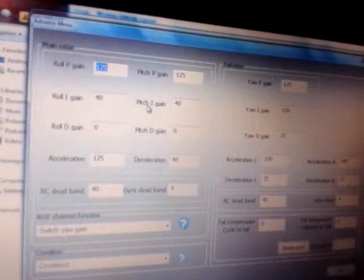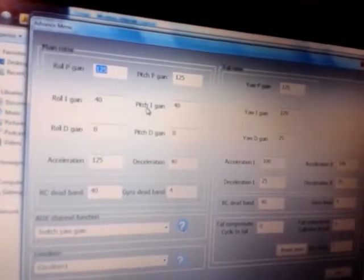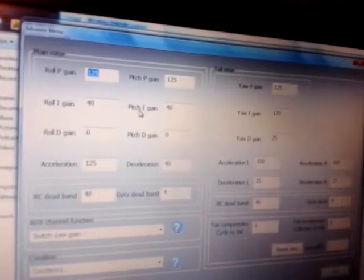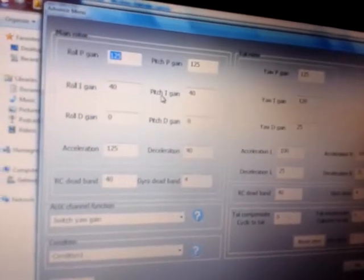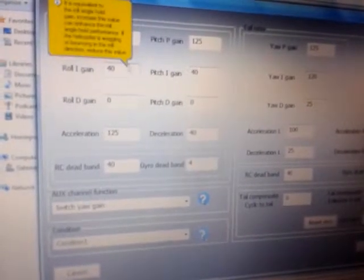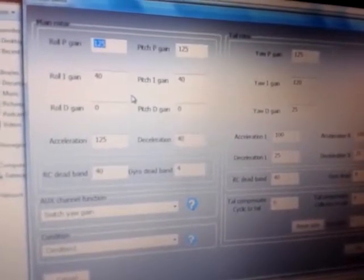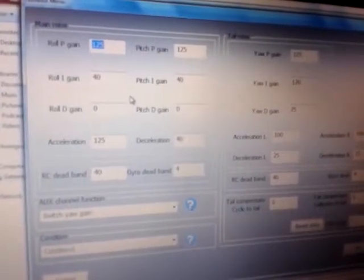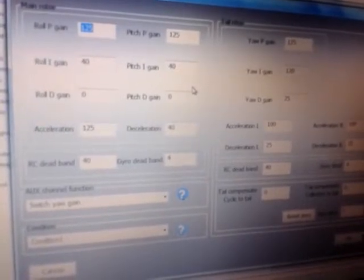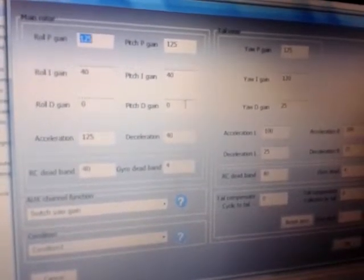Basically, if the vessel is in the air, obviously when you move the stick that much and the vessel does that move, the gyro is going to compensate for that. I mean, probably in theory, but the controls are different. It's confusing. So basically, if you don't want the gyro to do that, you cannot go to 120. My happy medium was like 40. I wanted the headlocking, but unfortunately at 120, complete headlocking, it's not controllable in the device that I built. So as a happy medium, I could pull it up to 40. That's all I could do. Now the response to stick is conventional, but it still does a little bit of headlocking. That's something you've got to find out, I guess.